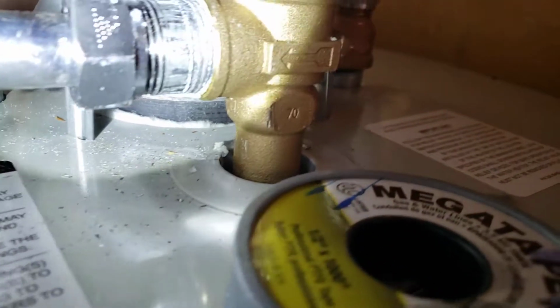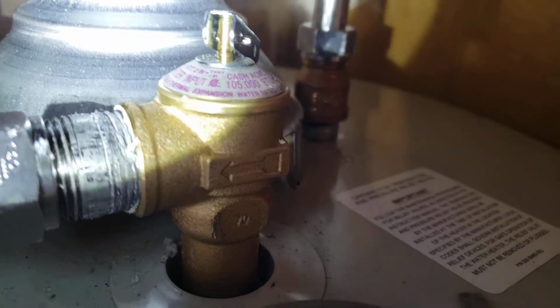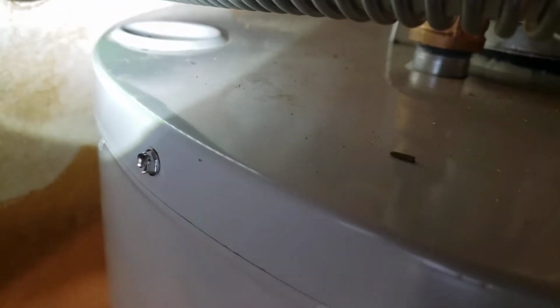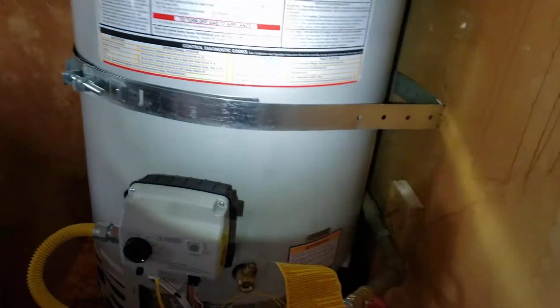This here is a relief valve, comes with the water heater. Temperature and or pressure is relieved. If you have trouble with the unit or this valve becomes defective or worn, then this will pop off and drain the water out. Another Falcon stainless steel connector. These are code 3/4 inch inside diameter, so that's good. Coming down here, you've got a new adjustable strap on the upper third. You've got a new adjustable strap on the lower third.